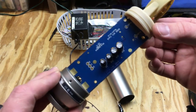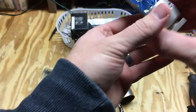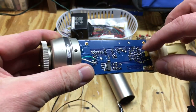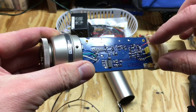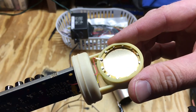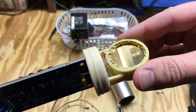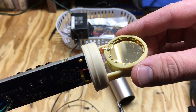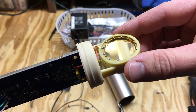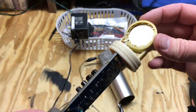This is what the inside of the mic looks like — got some capacitors, this is the rest of the circuit board, your connectors, 3-pin XLR, and then this is the capsule. At first I thought the crackling and pops had something to do with the cable or the mic preamp, and I checked all that. Then I thought maybe it had to do with the dust and particles visible on the capsule, so I checked that too.